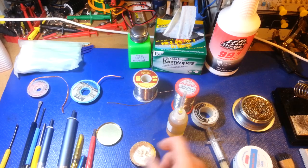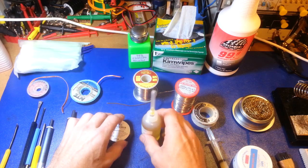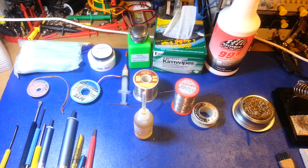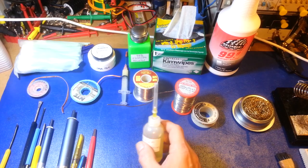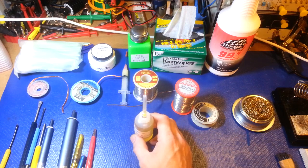The rosin is hard as a rock. I get in there with a razor knife, break it up, scrape it around, and dissolve it — there's about one and a half cakes in this bottle. It works extremely well. When you're working on vintage stuff you really can use that extra cleaning action, because that's what flux does — it cleans and prepares the surface as the solder starts to flow. If it's a partially contaminated or old surface, more flux is better.